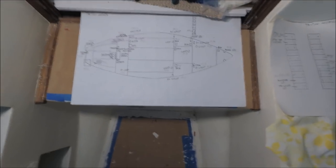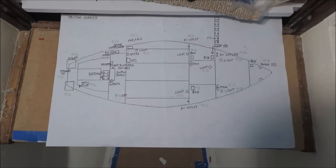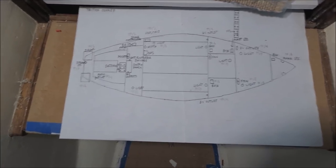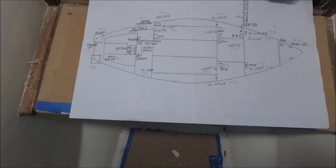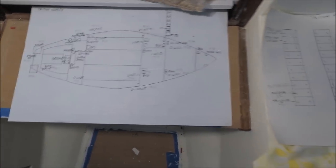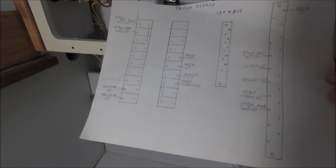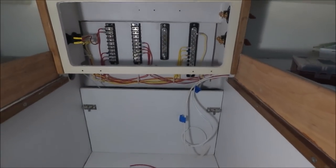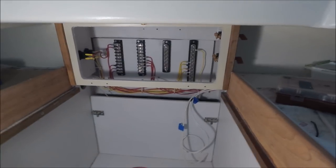I've made a sketch of an overall top-down view of the boat and highlighted where all the accessories, lights, batteries, outlets — where everything's going to go. And then this is a sketch of those wiring points. I'll complete that as I add wires so I don't get mixed up, and then I can add numbers to the wires later with little number tags.